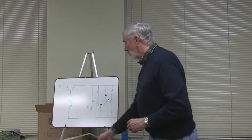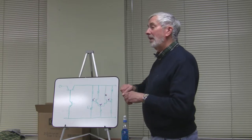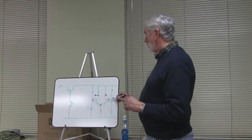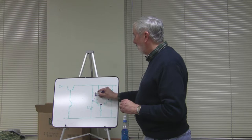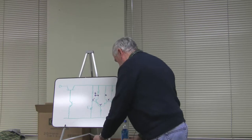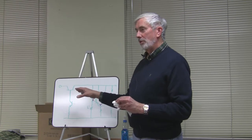When this transistor turns off a little bit, what happens to the voltage at the collector? There's no resistor in the collector load of this transistor, but there is a resistor on the other side — that's where we get our differential output. If this goes plus, and this goes plus, and this goes plus, this voltage is going to go in a positive direction. And that's going to cause this circuit to regulate.